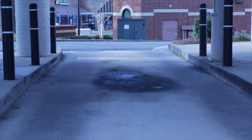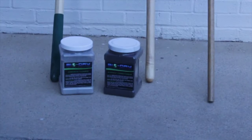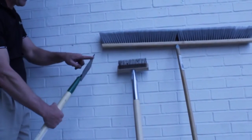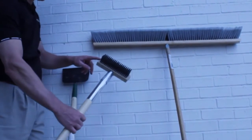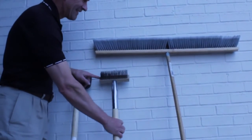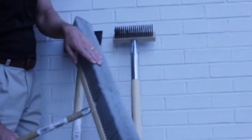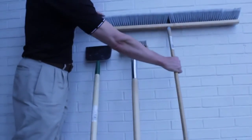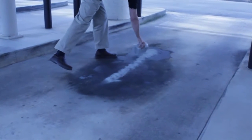To clean a bank drive-thru lane, the following tools are necessary: some BioDry product, both concrete and asphalt, a bladed scraper, a heavy wire rubber and a brush — preferably on a gooseneck handle to get a better angle at cleaning. And then the most important tool is the fine applicator broom. This is very important for the application of BioDry on concrete surfaces. Additional tools might be a blower and a trash receptacle.